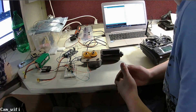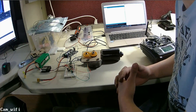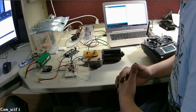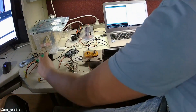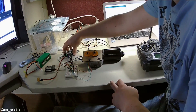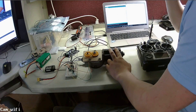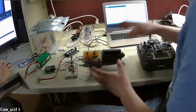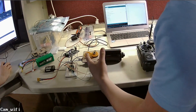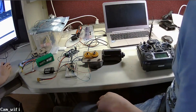We're making the Bat Baja remote controlled — it will be a one-to-one scale remote controlled car, which is going to be hilariously dangerous and awesome. So Bogdan, let's hear how it works. We've got your regular RC remote with a receiver, then an Arduino for doing calculations, a motor controller — this is actually half broken from the original turret when we burnt it out — and a motor from a windshield wiper, which means we get a lot of torque. We can control steering even if it's unpowered. We have a 12-volt LiPo battery to power the motor, and inside the motor is a potentiometer for closed-loop feedback. The Arduino has a command of the position, and it actually gets to that position — just like a regular servo would.